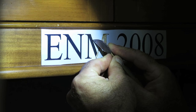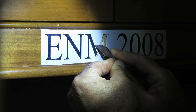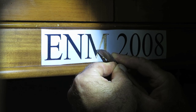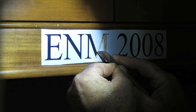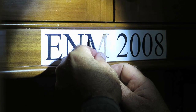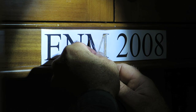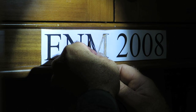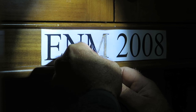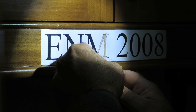With your pattern glued in place, the job becomes very carefully following the outline of the letters with your chip carving knife. You have to follow the edges of the letters perfectly. You want to start out right at the outside edges, not in the middle, and you can't go beyond that printed outline — that's really what defines the shape of your letter. As you can see, with the chip carving knife it's angled inwards as well.